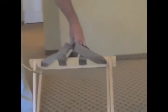Here we are going into the carpeted zone where the bed would normally set because the insects will be there. A treatment on a chair, once again, single passes as much as I can over the same zone so we don't get a lot of overspray. That'll dry and the particulate will be there. Underneath the work table, pay particular attention to zones close to those brackets. Carpeted baseboard, we're going to go ahead and put some material there. And a lot of those areas would have furniture. We put a little bit underneath that luggage rack because that's the perfect place for insects. And all that particulate will cling to those fabric zones.